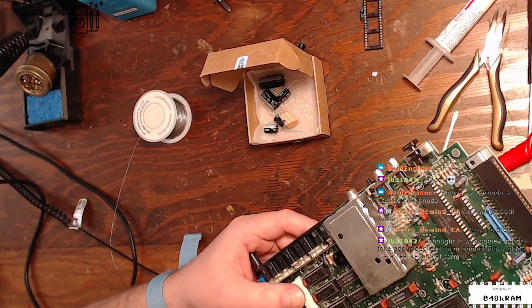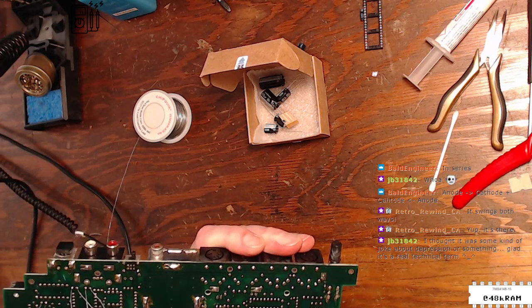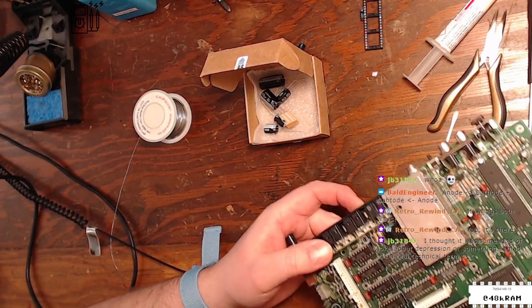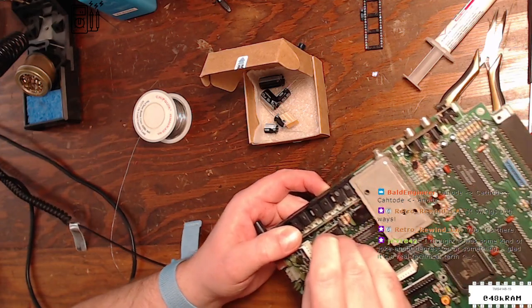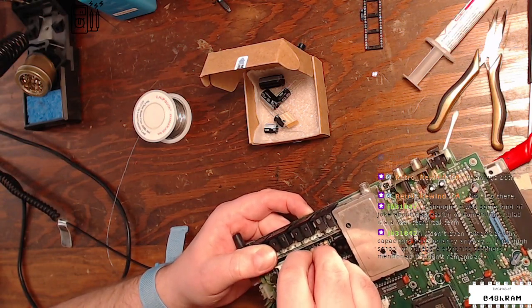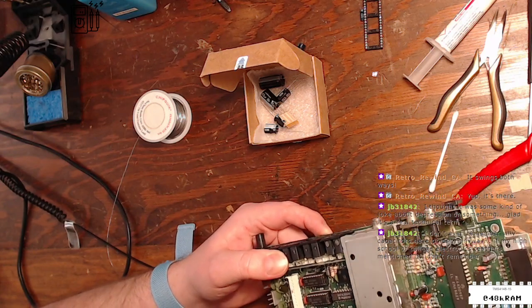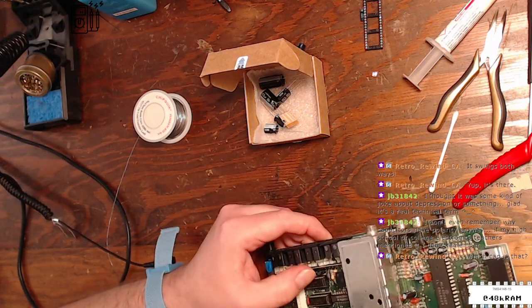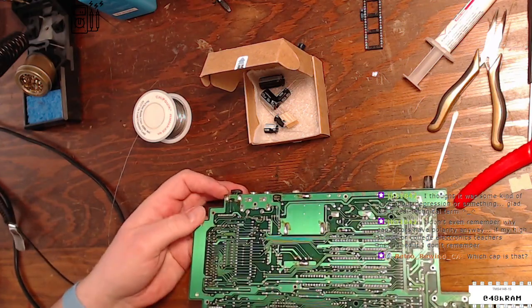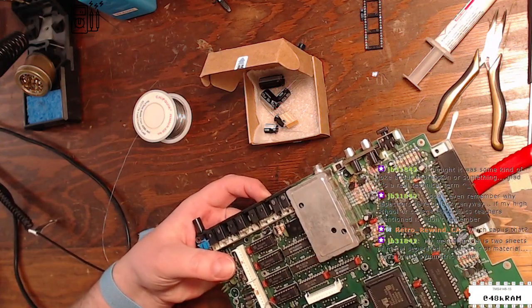And again, so this one's polarity is just not marked. That's a bummer. All right, so it's not connected on the back side. All the connections are here on the top side. And all right, so this one actually connects. I can see this terminal connects to a ground plane. So that's obviously the negative. I'm trying to see if I'm missing some clue on the silkscreen. I don't think I am. But this silkscreen is printed right up against some metal, so that should be the correct orientation. Which cap is this? This is C24. It's the last 10 mic 25 that I have to do.